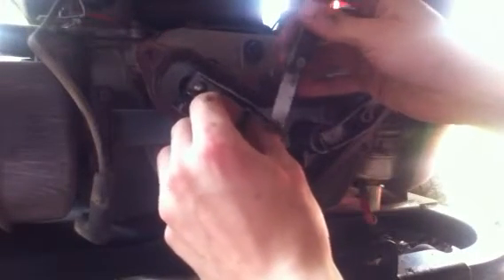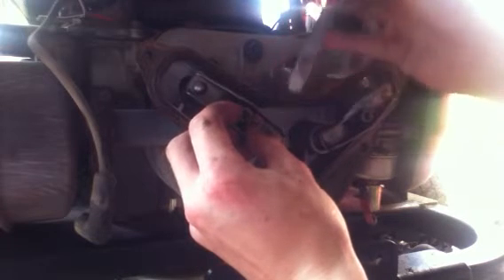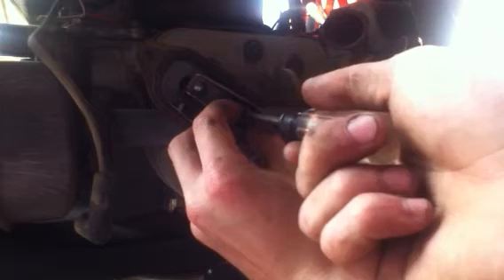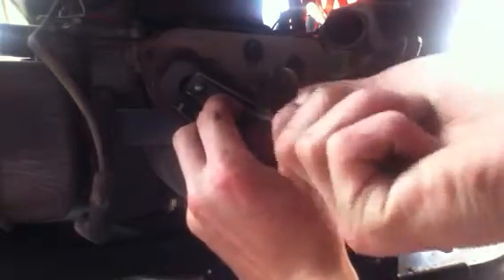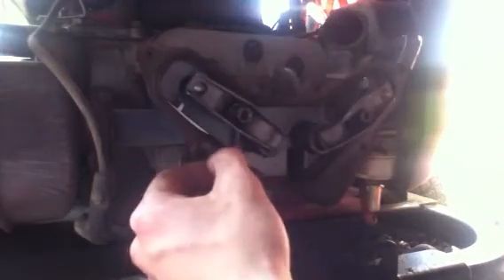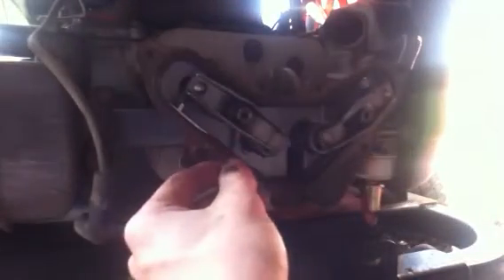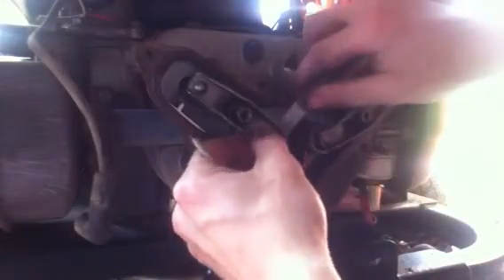While holding that tension, carefully tighten down the lock nut. Be careful — if you rotate the adjuster while tightening, you'll go off center. You can pull the feeler gauge out, hold the adjuster perfectly still, and get your fingers wrapped around there. Hold the bolt still, then tighten it down. After tightening, stick the feeler gauge back in — you want just a hair of tension, not so tight you can't move it, but not too loose either.